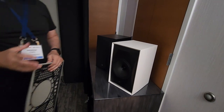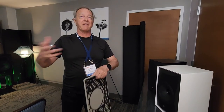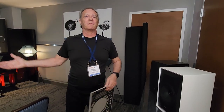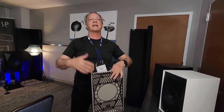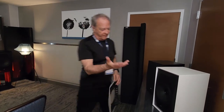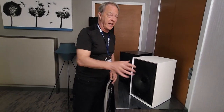I'm going from the 10-inch to the 8-inch and I wanted to retain as much of the character of that speaker. If I come out with an 8-inch that doesn't sound anything like the 10-inch, people won't want it. So I looked to retain as many of the parts that make the 10-inch driver as I could — exactly the same motor structure, exactly the same tweeter, the same cone except I just trim off about half an inch off the radius to shrink it to the size of an 8-inch driver. By trimming down the cone I had to use a new surround and change the chassis to be an 8-inch.